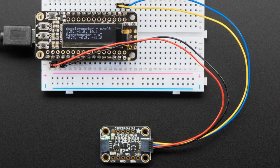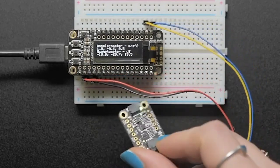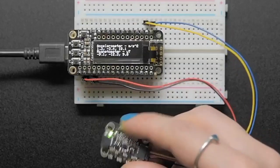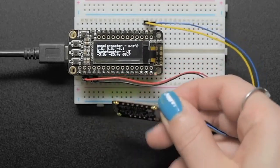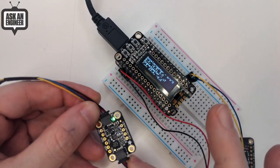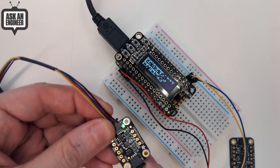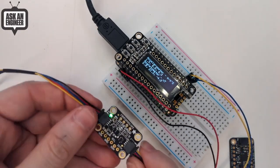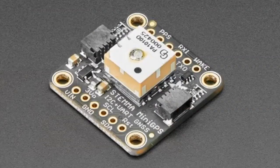Next up, looking very similar but not quite the same — the LSM303AGR. We've carried a couple of different versions of the LSM303. It's a magnetometer plus accelerometer, sometimes called an e-compass. This is good for finding magnetic north. It can do tilt-compensated compass activity. It's a six-DOF sensor but a different kind — magnetic, not gyroscopic. We do have some nine-DOF sensors as well and more coming. You can see it kind of tells you which way north is — X and Y are positive, and north is kind of behind me, and the values maximize when it's pointing that way. The accelerometer tells you the tilt, and we have code for calibrating and calculating which direction is north even if it's tilted in any direction — that's what your phone uses too.